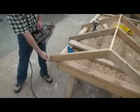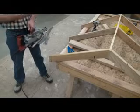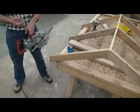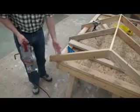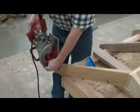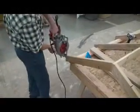We are going to now cut this plumb line in place. It's good practice while you're in the lab here to make several cuts with the rafters in place, because on the job site you'll often need to make these types of cuts with the rafters in position. You may be tempted to cut from this side of the rafter, but beware that when you make that cut, when that blade or the guard of the saw retracts, you actually expose the blade directly to your body. So it's much safer to make these types of cuts with the blade facing away from you.